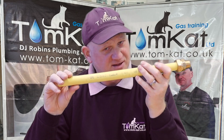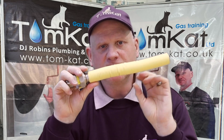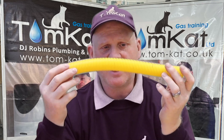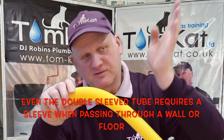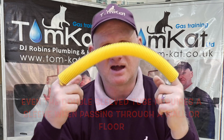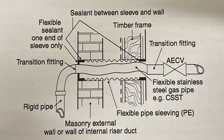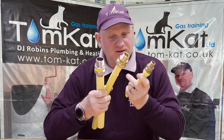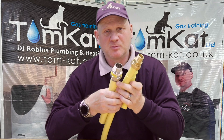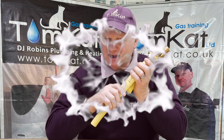If you have single-sleeved coated stainless steel pipe, you'll need a separate containment sleeve for passing through cavity walls, floors, or any void. The containment sleeve is particularly good for timber frame houses with brick on the outside - your TrackPipe slides through the containment sleeve. Apologies to the other two manufacturers for keep calling everything TrackPipe, but that was my look at corrugated stainless steel gas pipe. Hope you've liked the video - catch you on the next one.